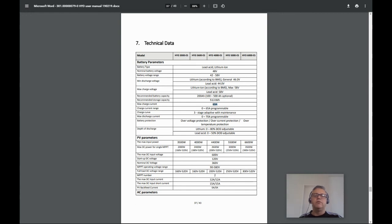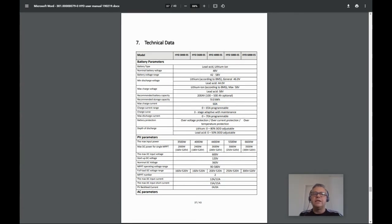If you are planning on having 3,000 watts of usable solar power from solar panels for 6 hours a day, you aren't going to have much left for other things. Half the day would be spent charging the 10 kilowatt hour battery. Let's take an example. Let's say you had a 10 kilowatt hour battery and you wanted to allow for your solar panels to produce 75% of their rated capacity on average across 6 hours of sunlight, and you wanted to allow for an average of 3,000 watts for your home use on top of the battery charging.